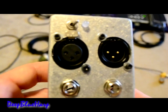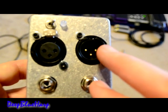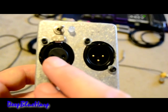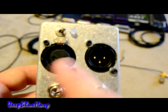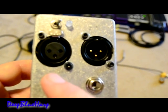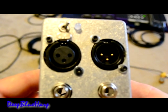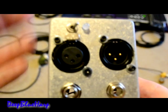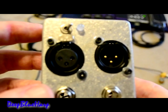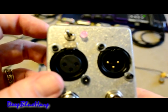This is the stomp switch itself — the mute. This goes to either the amp, the sound system, wherever you're playing, to the pedal board. This side is live, and this is the side you will not unplug once it's plugged in. This side is where you plug in your guitar, your instrument, your microphone. I've wired it so you can have a tip-ring-sleeve connector or an XLR standard connection. This device works with either, including devices requiring phantom power because it passes it straight through. High impedance, low impedance — it just doesn't make any difference. Basically this is a 1Hz filter, so anything over 1Hz cuts the pop out — the pop, hum, clack, boom that you really don't want to hear. The only reason there's an LED is that when it's red, this side's dead; if it's green, it's live. It's just an indicator — you don't have to have it.